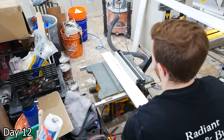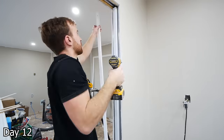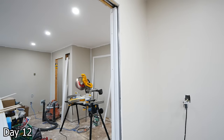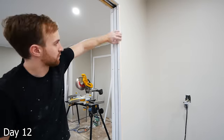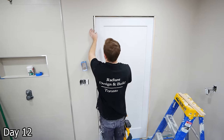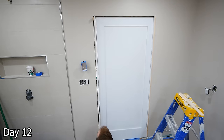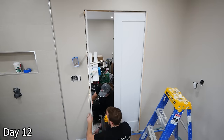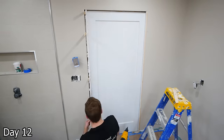For the pocket door here, making some custom split jambs — we just bought some wood jambs, using a solid one for where the door will close, but for the top and side, we do have to cut them as it's a pocket door. Just a little bit of custom work — we're using these self-drilling screws to get through that steel frame. The only true way to get those two split jambs absolutely perfect would be to wet shim, but our install was really clean so they were almost perfect. And then for where this door closes, we're just going to go ahead and shim it out so there's absolutely no gap between where that door is and where it connects to the jamb.